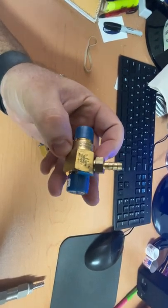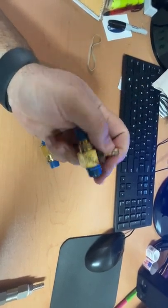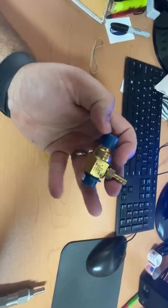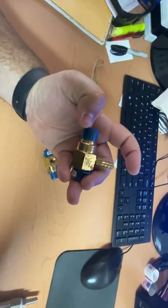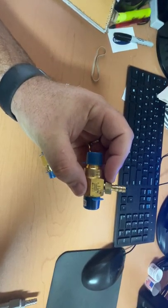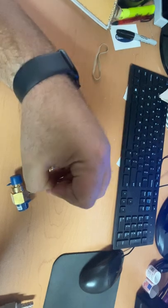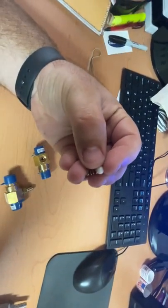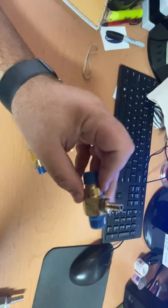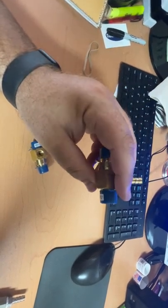These things are really handy, they last a while, they're pretty reliable. Essentially you hook up your quick connects where these blue caps are, and then this is a hose barb here that creates a suction and allows chemical to enter through here. Inside, if you take this apart and remove this little fitting off this hose barb, what you have is a spring and a ceramic ball. As chemical flows through, the spring compresses down and allows liquid — whatever your liquid of choice is — to enter through this orifice and then go into your pressure hose.